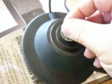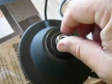Put the cap back on, put the star washer back on, put the nut back on, and cinch it down. Throw a little bead of silicone around where it goes in and you're going to be in pretty good shape. That's how you replace coax on a mag mount. Thanks for watching.